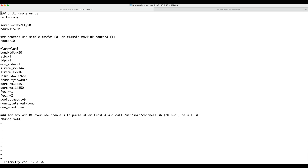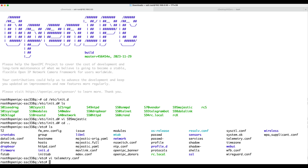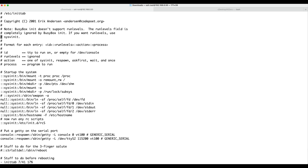Then we're going to edit the file called telemetry.conf. This one makes a bit more sense — it actually tells us the serial port we're using, and we want to use S2 on this particular one. It took me quite a while to figure out which port was which. If you tried logging in using that serial port, you'll also want to go into inittab and comment out the TTY — basically running a getty will let a console login happen on that port. It doesn't change your ability to SSH in, but this is fairly important.